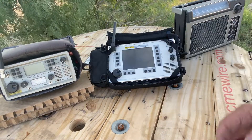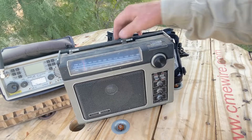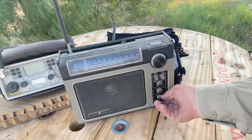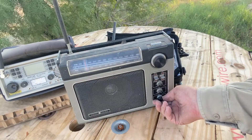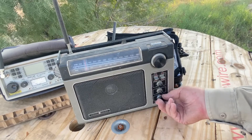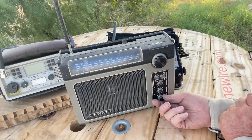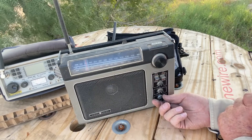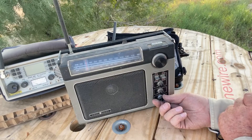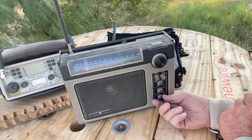Let's take a look at what my AM radio does. If I was patrolling, I usually use 530 AM or 1710. Being off station, it takes less static to bring interference into the radio. If I'm on a radio station, the noise has to be significant to cover up the power of that radio station.